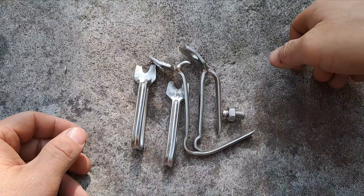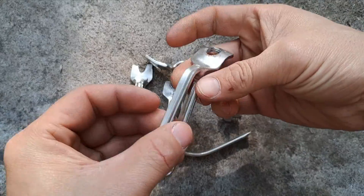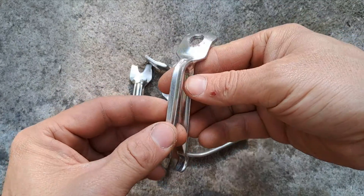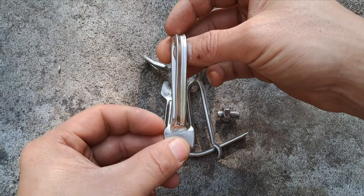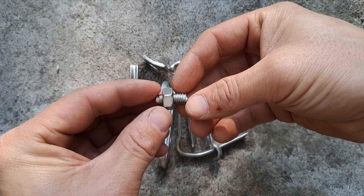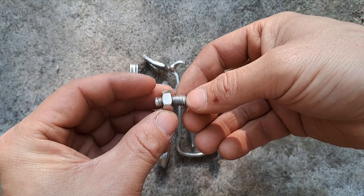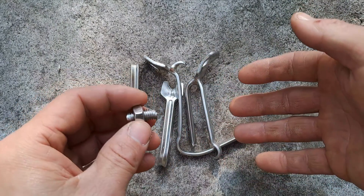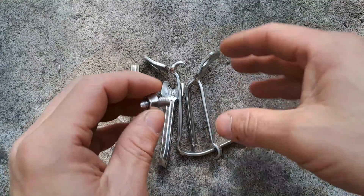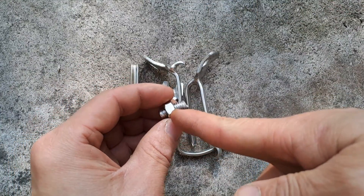So here's some observations from just our few tests. When pulling from within the eye we got an average of about 35. Pulling from the hanger hole and the eye we got about 26 kilonewtons, which is what they're rated for. With these 8 millimeter wedge bolts we got about a minimum of 22 kilonewtons. The thing with anchors is they're only as strong as the weakest point, and in this case it's the wedge bolt.